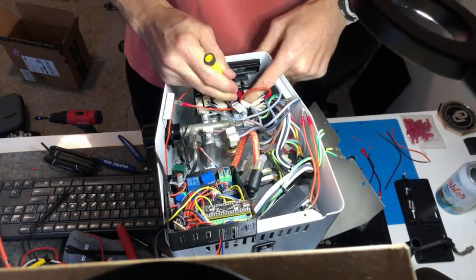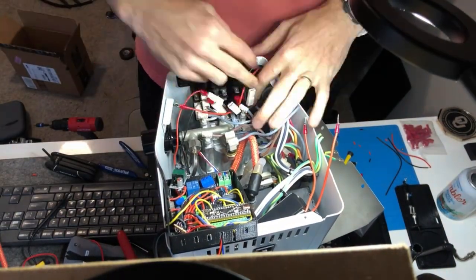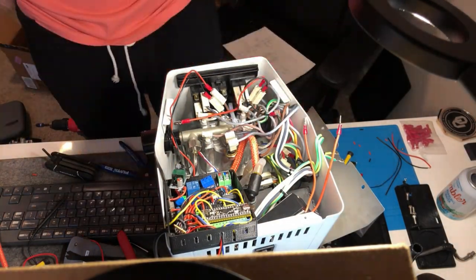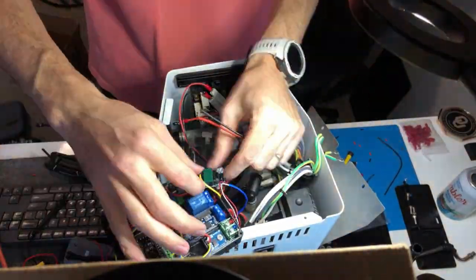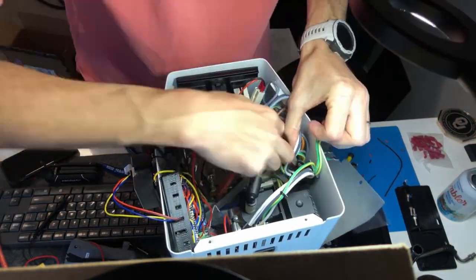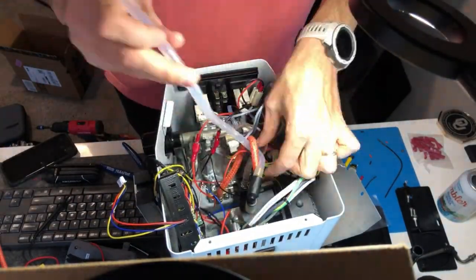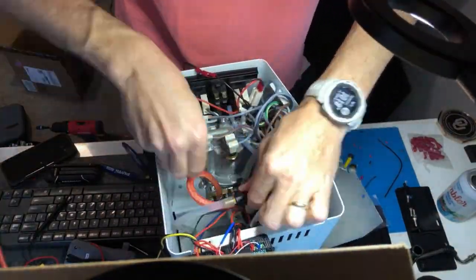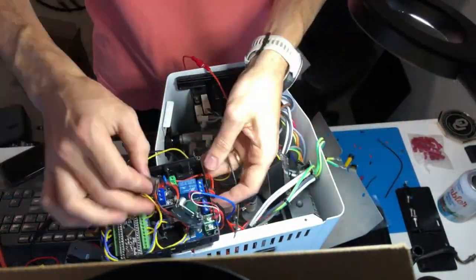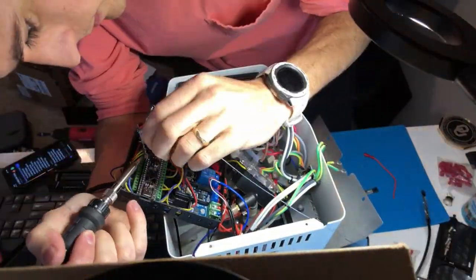Now is connecting the high voltage wires into the power switch. So I'm taking the top two wires off and the bottom two wires off. The bottom two wires get piggybacked into the AC to 12 volt in the component housing, and everything gets connected back the way it was. Very important step right here is to use a multimeter to check what is coming off of the poles on the top switches, so that you know that you're not connecting to the always live connections and you're connecting to the ones that become live when you flip. Make sure to thoroughly read the documentation that talks about using a multimeter at this stage.